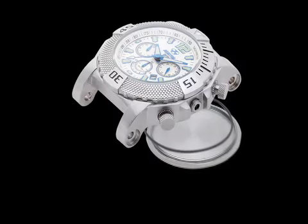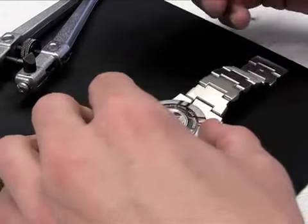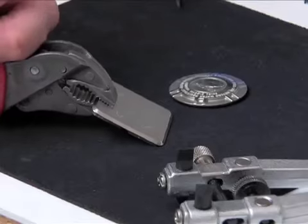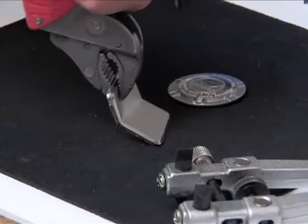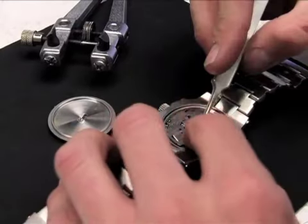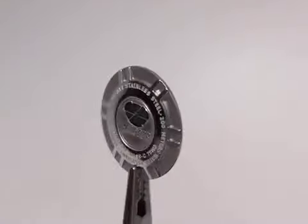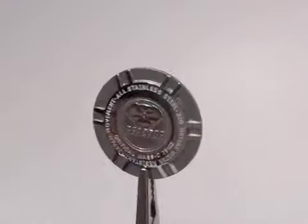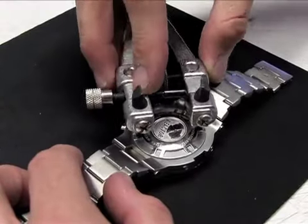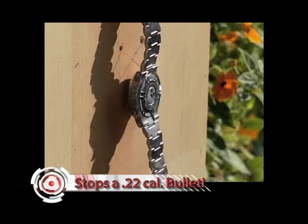The final key component in watch construction is the case back. As the largest opening in the watch, the case back plays a vital role in water resistance. Many watches in Reactor's price range use case backs stamped from sheet metal. This forming process, while inexpensive, produces case backs that are easily distorted and can be difficult to seal, especially after a battery change. Like most fine Swiss watches, Reactor uses a forged case back produced with the same process used to make our cases. These forged case backs are thick, strong, and perfectly flat, assuring a watertight seal even after a battery change. Recent testing showed they will stop a bullet — the stamped case back didn't fare so well.